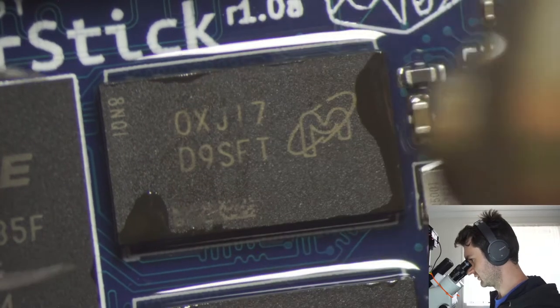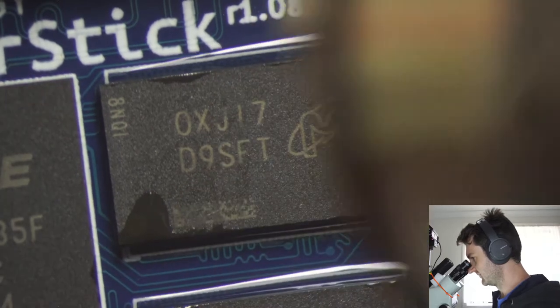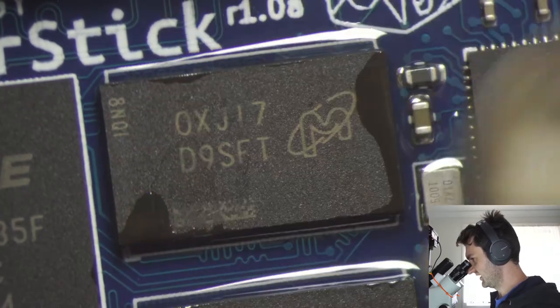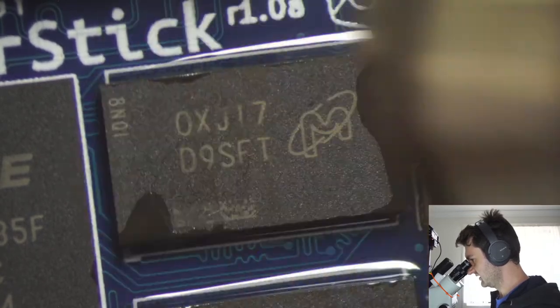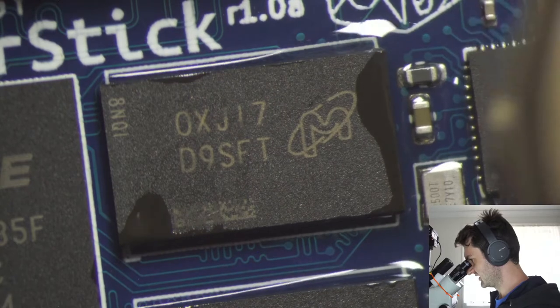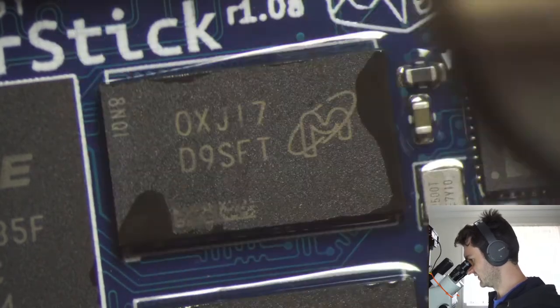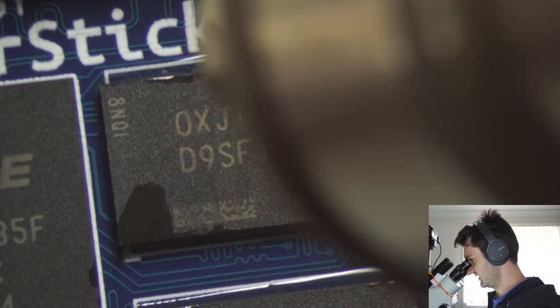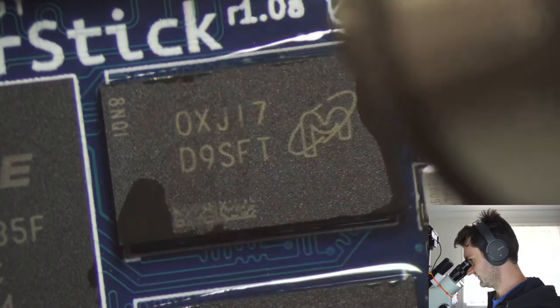So if you think of a typical reflow process that the circuit board runs through, they take about 7 minutes to heat up to maximum temperature and then cool back down. You should be thinking similarly when you're using a hot air gun. You don't really want to be blasting a ton of hot air at the parts, trying to reflow them in 30 seconds or anything like that. It's okay to take your time.